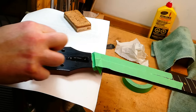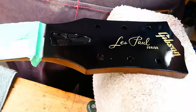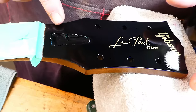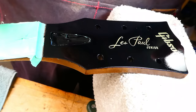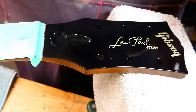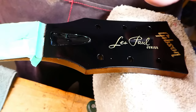Before putting clear coats on top, I'm going to lightly sand with 1200 again, focusing on the edges of the decals, trying to thin them out a little bit and blend them. Even though they're thin as a hair or even less, it eventually transfers as a height difference in the layers of lacquer and you can see it. Let me recap, as much for me as for you, because it's been several weeks. I started with black dyed veneer, shot two coats of black lacquer, then three coats of clear lacquer, let that sit for a few days, sanded it more or less flat, installed the decals, shot four more coats of clear, sanded that level, then shot two more — eleven coats in total. It's been sitting nine days, and I think I'm ready to do the final leveling and polishing.